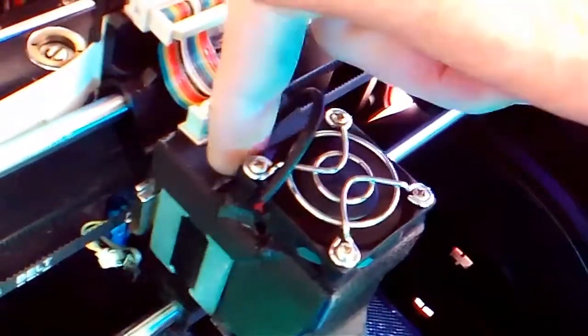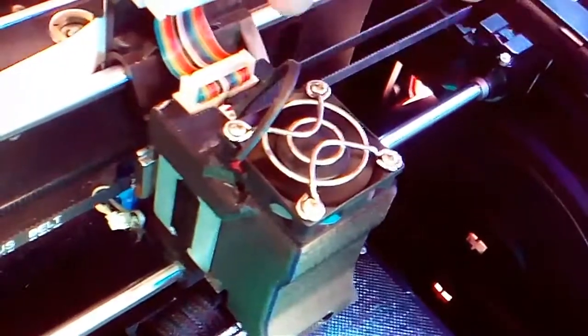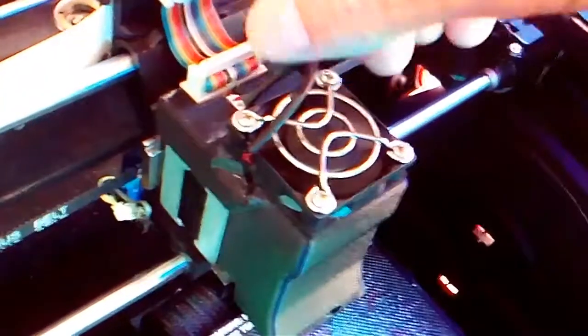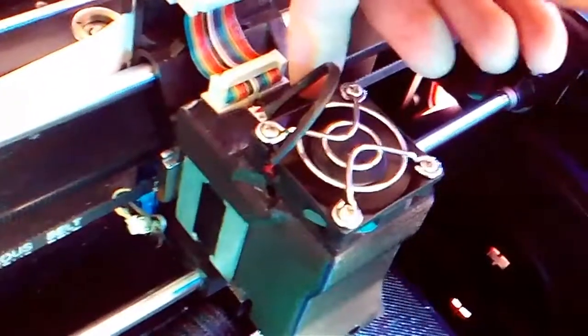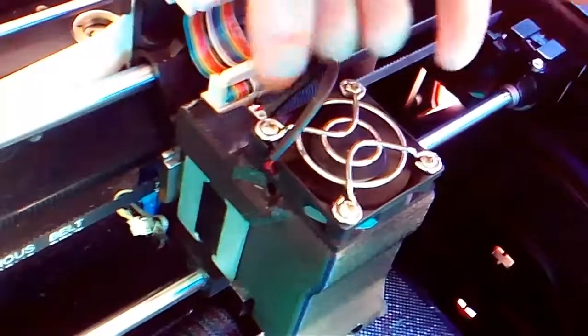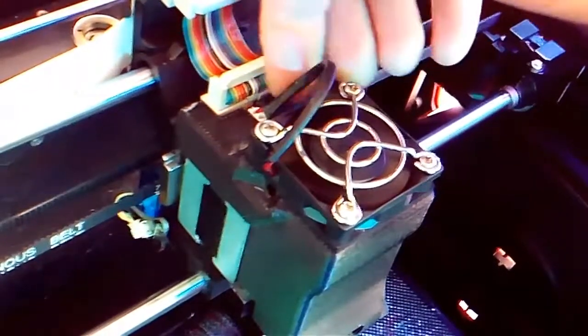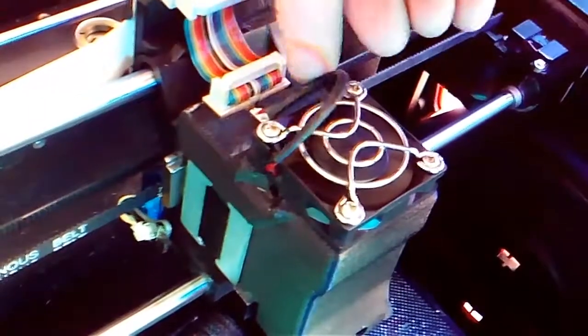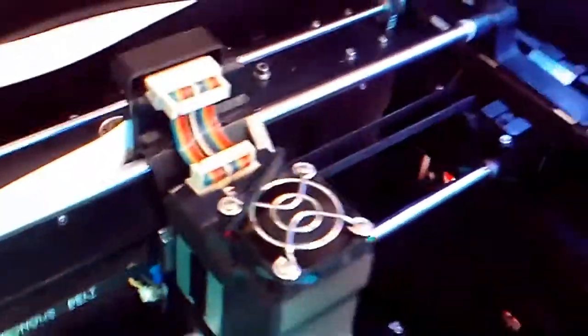The interesting thing is, underneath this cover there are two little connectors — one goes down to the stepper motor, and on the other side it goes to the hot end and the temperature sensor. I found that initially pulling that plug off was quite difficult — it was almost stuck in there. So it was almost like there were perhaps vapors or fumes with contaminants that had gotten into that connector and somehow created an isolation in the connection for the temperature sensing.